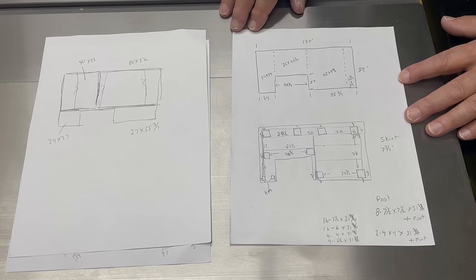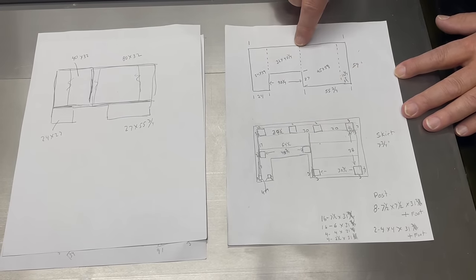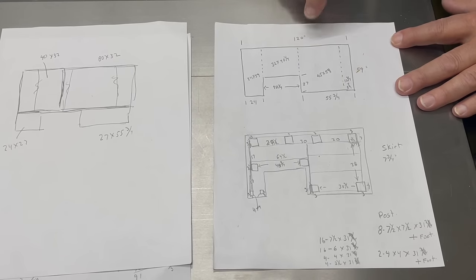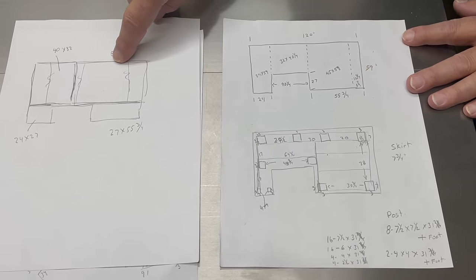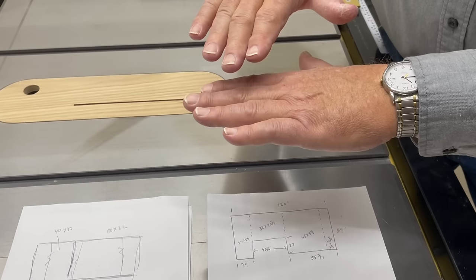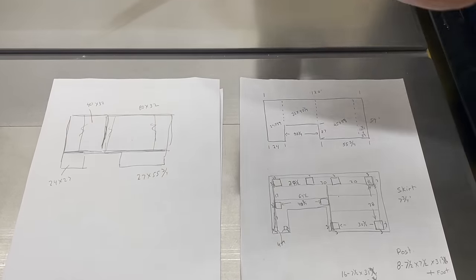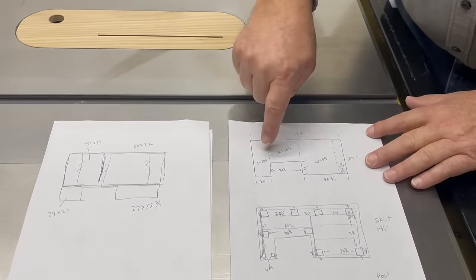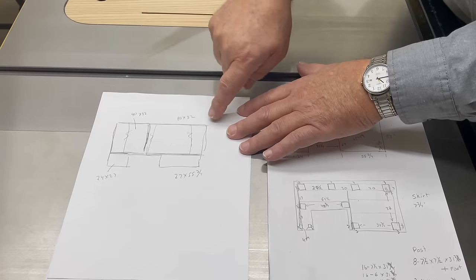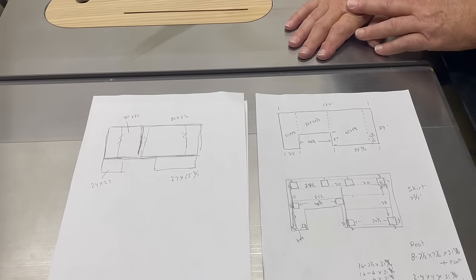As I was making my working drawings, I made three drawings of our tabletop. One drawing shows where the legs are going to go. The second drawing shows the finished 59-by-120 white melamine top flush with the tabletop. The third drawing shows the underneath level — the top will be two thicknesses: the bottom is particle board, the top is white melamine. I didn't want the seams to line up, so I drew them out so the seams overlap for extra strength. I'll cut the particle board sub-layer first.